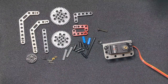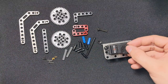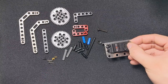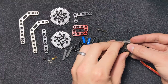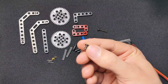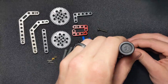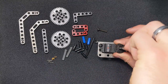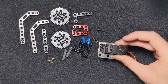The next thing we're going to do is mount this servo horn to the servo. If you're looking for this piece or any other pieces, there's a plastic bag inside the bag that your servos and motors came in, and all those pieces will be in there. We'll put that on, then take the little black screw that was in that bag — there's always one per bag — and screw it into the servo horn so it stays on and doesn't fall off.